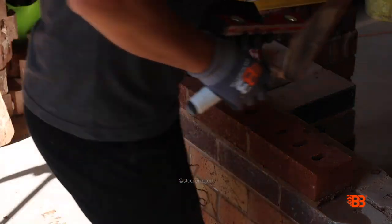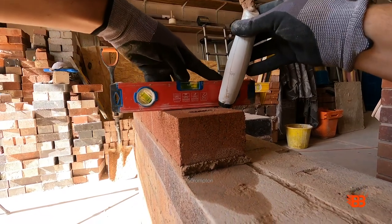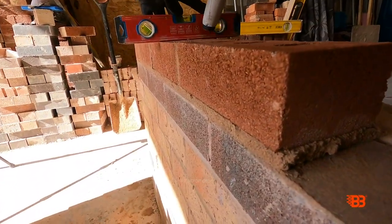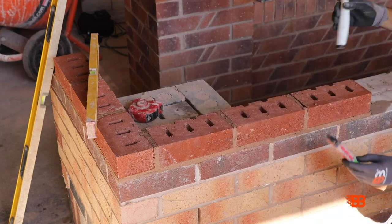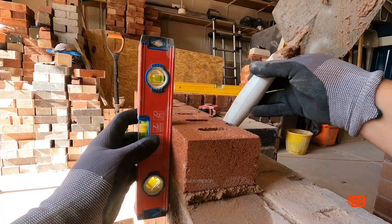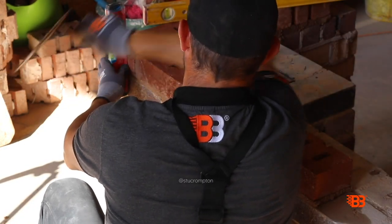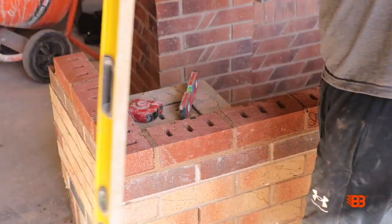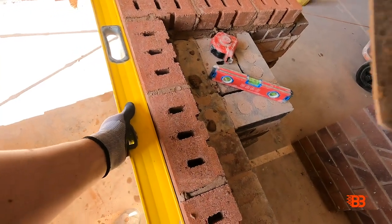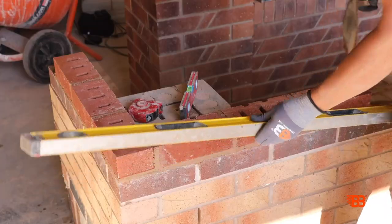Just going to check — we're going to range that in. Last thing, we can check on our level. Just tilting back a bit. Okay, let's check that on our plumb. That's our pin — Point B sorted. Point A — that's moved a little bit. That's good. Now we can range them in. Long level, give it a clean. Get any daylight — that's good. Rub it up to the top, no daylight. That's very good. That's our first course sorted, ranged. B fits.